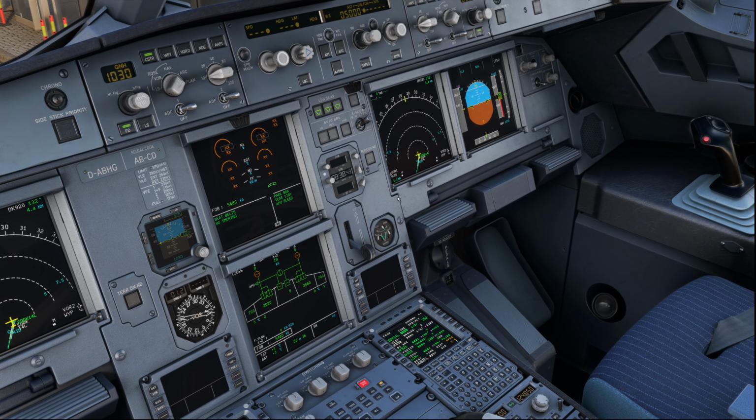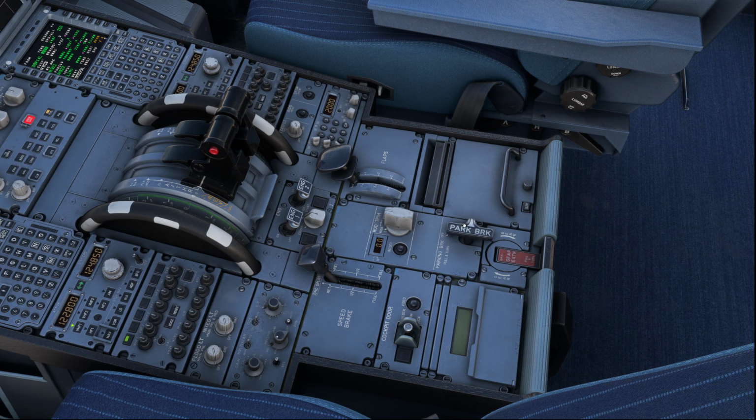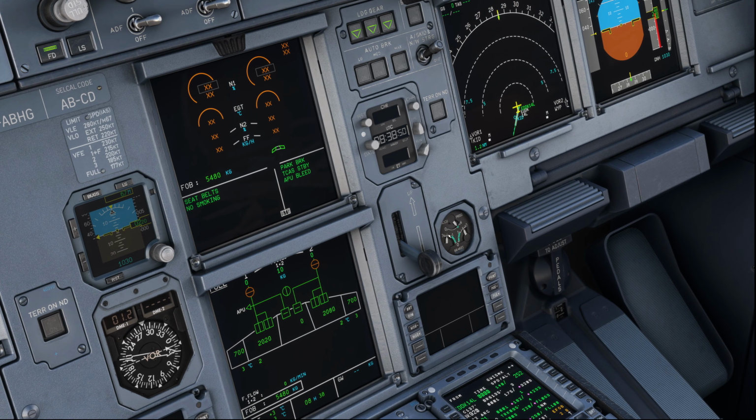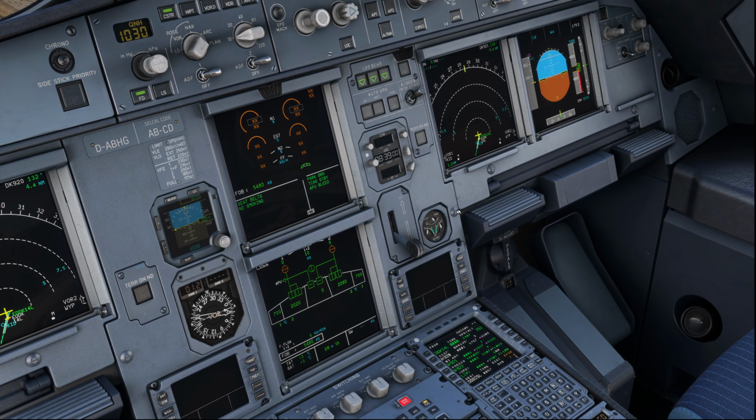Always remember, you might release the switch over here, but if the switch fails, remember it's all electrical connections. A connector might be broken, and the brake is still set over here and they start pushing you. That's going to get expensive.